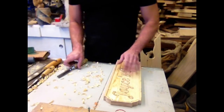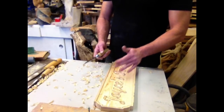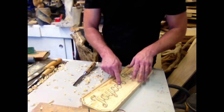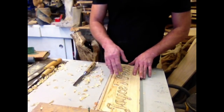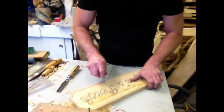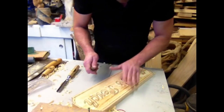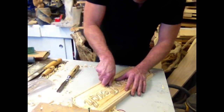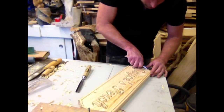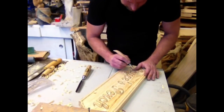At no point in time do I go across grain. If I go across grain, especially on pine, I tend to get tear out — it leaves quite a nasty background, so I'm always going to go with the grain. I've got a few little spots where I've gone below my cut line. You can either take the router and go over again, or you can use a cutting knife — this is just a little Flex Cut carving knife — and I'll just follow my pattern there, making a new cut line. That way you're not tempted to try to go too deep or do the impossible with your gouge. You're just scoring the surface, and that should be enough.